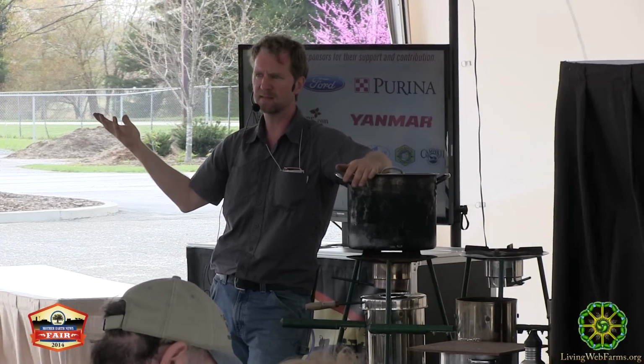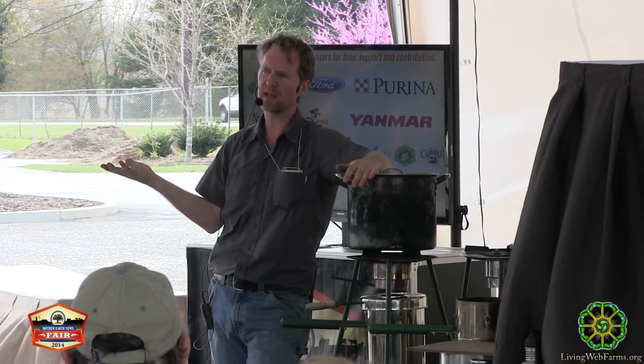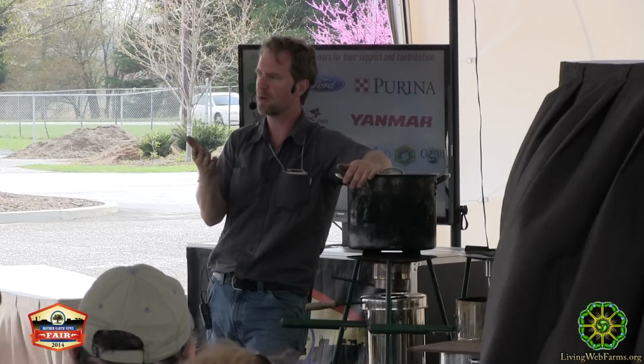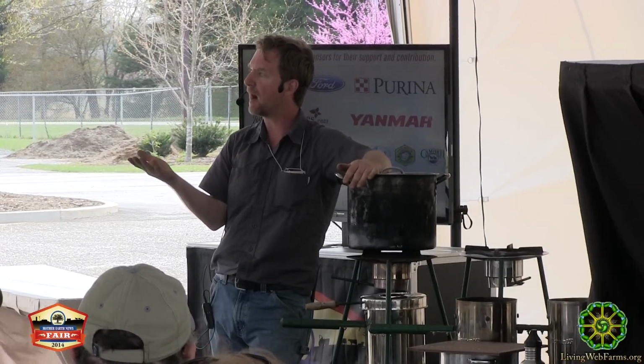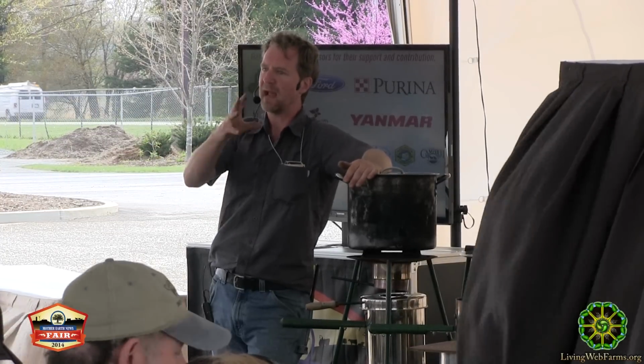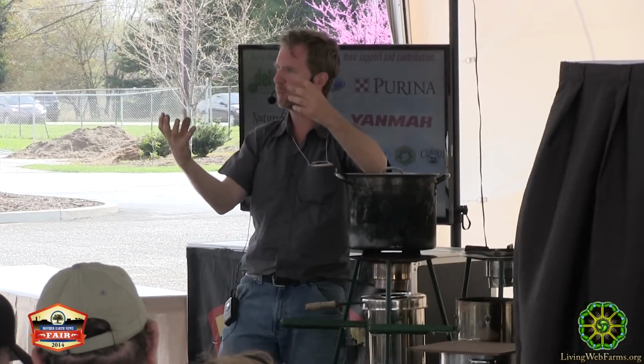Does the word pyrolysis, is everybody familiar with that word? For people who aren't, if you've ever heard the word electrolysis, people are more familiar with that word for some reason. It's like breaking something apart with electricity. Pyrolysis is breaking something apart with heat. Pyre, like a fire, funeral pyre. And so you're adding heat to the wood in the retort. That's literally called destructive distillation. It's breaking the wood apart into wood gas.